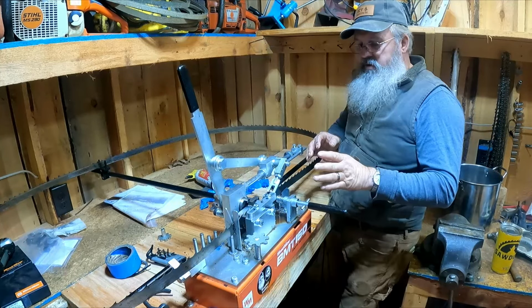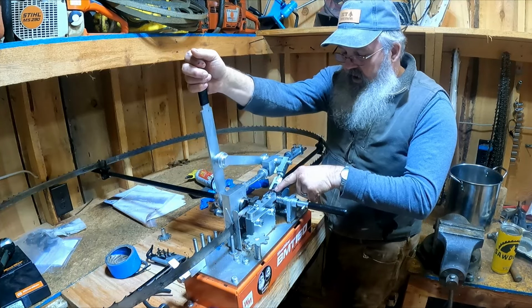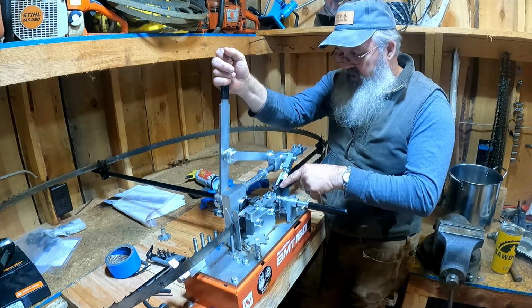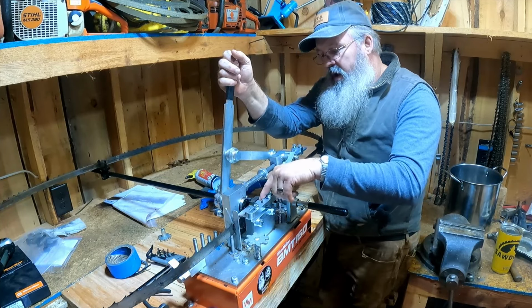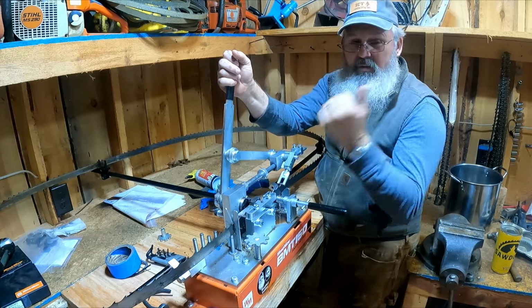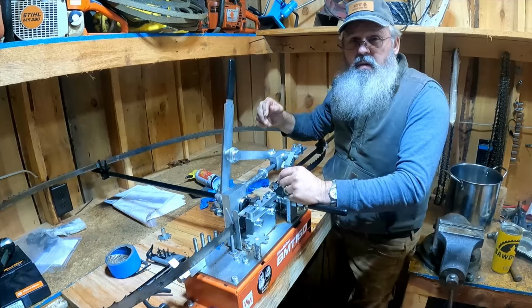You have to be careful with this machine. When it comes back, it strokes three teeth. You go forward. If you accidentally stroke two, now you're bending the wrong tooth. You have to really concentrate. Make sure you get three. I'm normally sitting right here with my eyeballs, watching that tooth on the first cutter to make sure it's leaning this way, because that's the way I'm gonna bend it. So let's run these around. We'll take this minute and we'll be done with this blade.